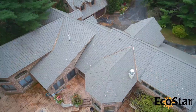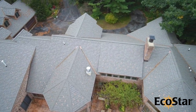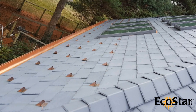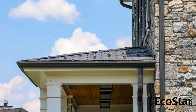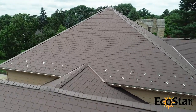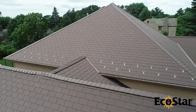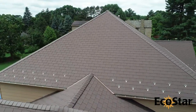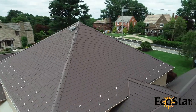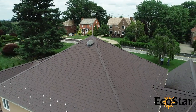Accumulated snow tends to slide off of EcoStar tiles all at once. An effective snow retention system should be part of the roof plan where snow is common. EcoStar recommends choosing a snow guard that features a flat sheet metal nailable mounting flange, available from numerous manufacturers. Snow rails may also be used. Contact the snow retention accessory manufacturer for details about number and placement of snow guards or snow rail mounting details. Contact EcoStar if in doubt about customer-selected guards, as incorrectly installed guards can lift tiles.